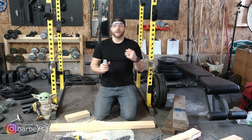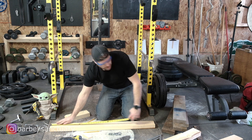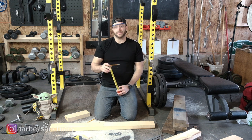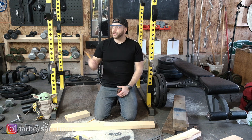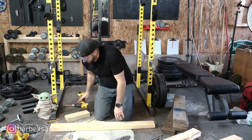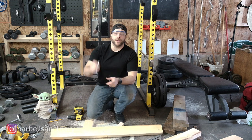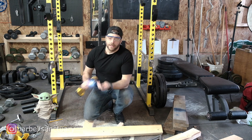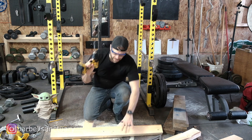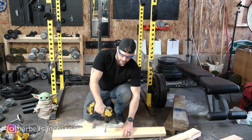This will be my middle piece. I'm going to take the middle piece that I'm going to attach my carabiner to — just get the middle. It's 44 inches, so it should be 22 inches. I'm building everything to spec to my rack, so don't take my measurements — take your own measurements for when you're doing yours. So I'm going to be putting a bolt and a washer through this. I don't want it to hit the floor, so I'm going to take a 3/4 inch spade bit and just countersink it a little bit, just so the bolt and washer go into the wood and don't stick out.